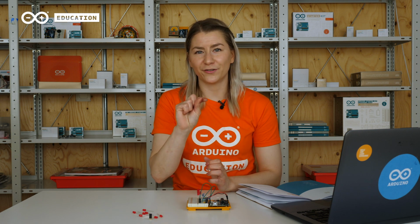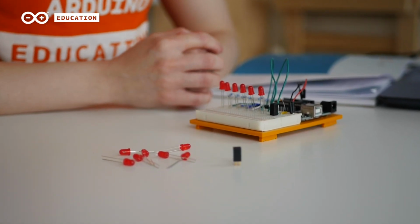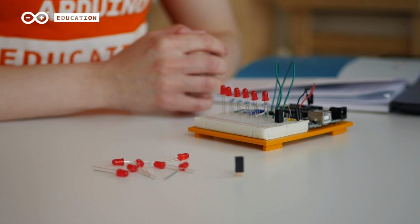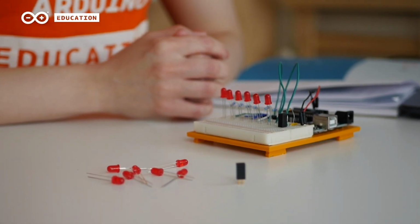A traditional hourglass has sand inside, and whenever we turn the glass, time starts running. In today's project, we will use the tilt sensor in the same way. The tilt sensor we have in the kit has a metal ball inside that will make a connection across two leads when tilted. The tilt sensor is a type of switch that can have two values, open or closed, and we can read those values using digitalRead in our code.